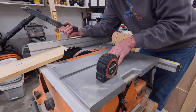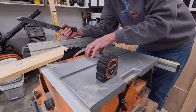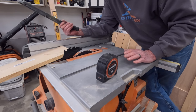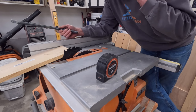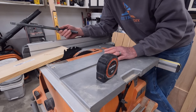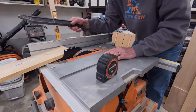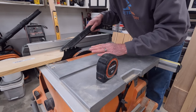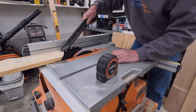I was watching an Andy Birdsall build video — he finished his cuts, did not turn the saw off, reached in to get his off cuts, and put his fingers right in the blade. A horrible thing to see happen. He was wearing headphones and listening to a podcast, and had probably become very complacent with the saw. Just not the mistake you want to make. When the cut is complete — even if you're making repetitious cuts — turn the saw off.